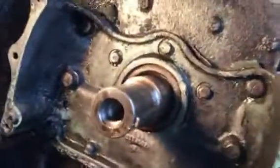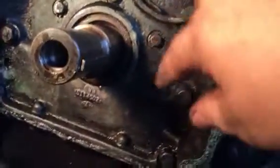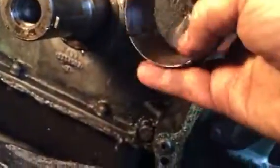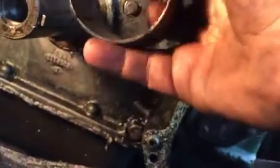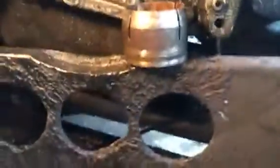One thing we noticed was different: when I took off the dampeners, they bolted in from the back side, which is backwards — normally it's from the front side. You can see the bolts on a 4104. Once I got the inner cone off — it's like a tapered cone that goes on there, the oil seal rides on it and it centers everything up — when I took the old one off, I'll set it here just to show you.